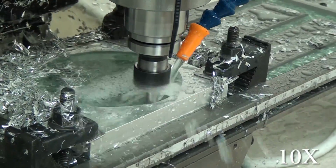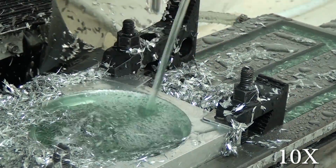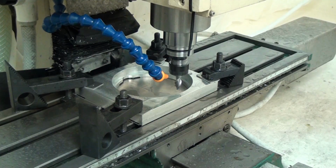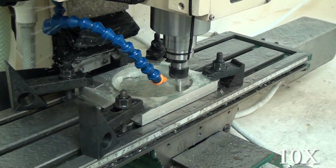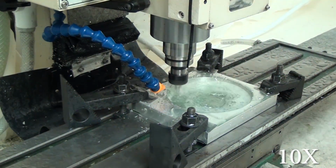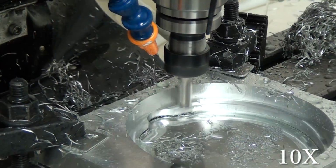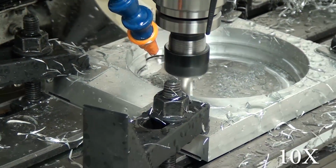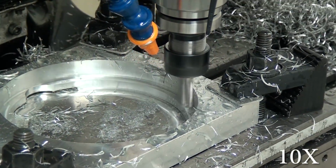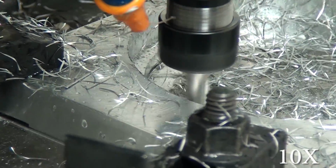You can also kind of tell, if you look at the top and bottom of the y-axis, right there you can see it is clearance for the carriage bolt heads, and you'll need that as well. So again, just some more passes, cleaning everything up. And no, I'm not machining right on the table. I've got a piece of, I think, 1/32 aluminum sheet underneath the plate, so that way I don't gouge my end mill into the table.